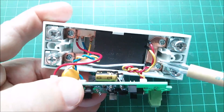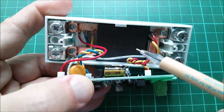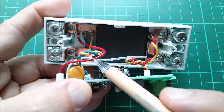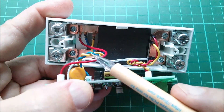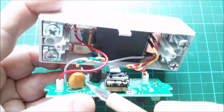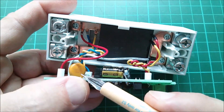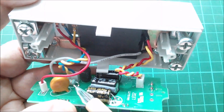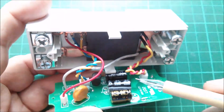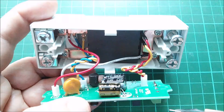There's a section that is slightly silvered — that's the current shunt — with blue and yellow wires either side of it. There's a neutral connection via this white wire over to the neutral bus bar. So this thing can measure voltage across red and white, and measure current flowing through this shunt on the yellow and blue wires. Also in here we have what looks like a capacitor marked 681, a large power-rated resistor — brown black brown, 100 ohms — and three electrolytics and a little inductor.